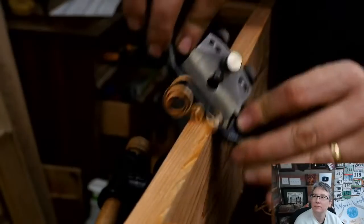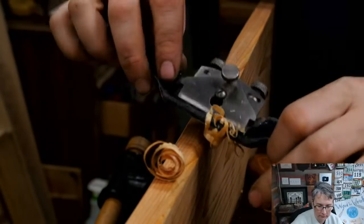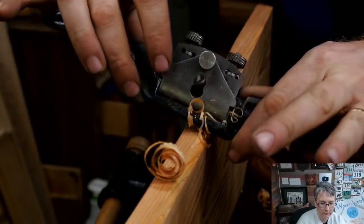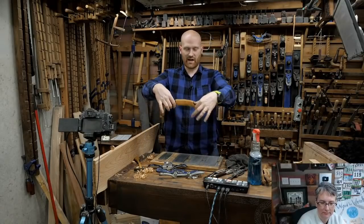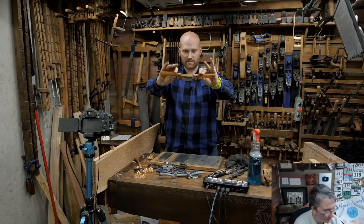And going against the grain now. And so the other fingers out here are more or less just stabilization. If I'm really getting into something, they'll come down and hold a little bit more, but I'm not actually grabbing the plane. All the force is on these fingers here. And it's going to be the same across all of them. The thumb goes on either side, and that's what's putting the force into it. Index finger comes on top, and that's what's grabbing it.